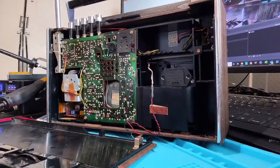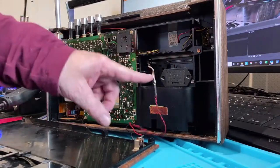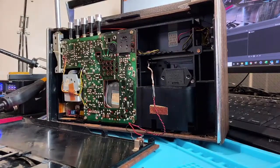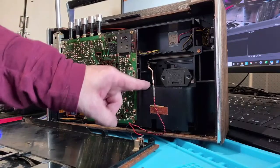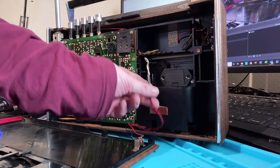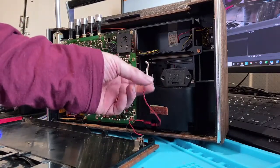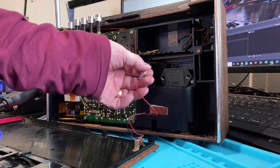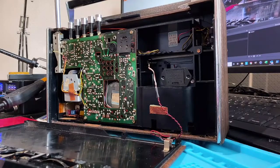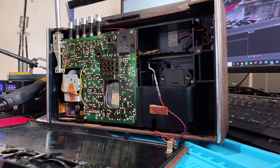So it's pretty much all back together. I put this battery case in like I put in on some of the other radios. Doesn't mean you have to take the back off to change the battery, but it's still possible to not use that and use the 6 HP2 cells or the big D cells if you're into carrying really heavy things about, or if the PP3 turns out to be not meaty enough for it. I've also bypassed the bizarre white positive, brown negative convention here and put that back to that socket in a more conventional way. Yeah, so I think it's ready to go back together and have a full test, really.